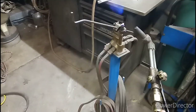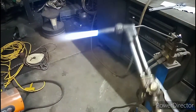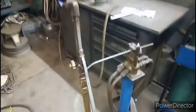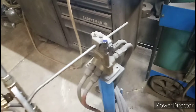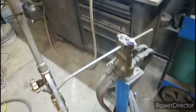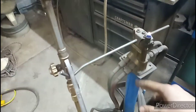I'm going to light it and come up from the underside — and you're lit. Shut it off and she goes right out. Pretty convenient, but there's only a few hang-ups: you've got to come from the underside with your torch. If not, it'll blow this little pilot flame out, and you don't want to burn any of this up, especially the hoses. But yeah, you just pick it up, make your cut, hang it up, and you're done.